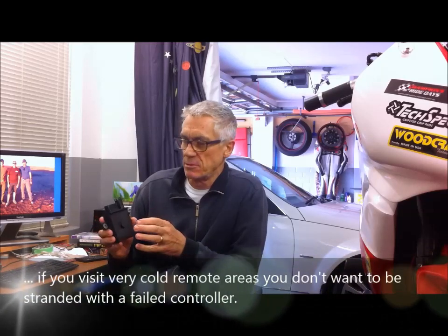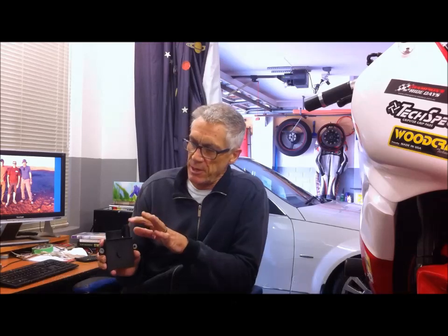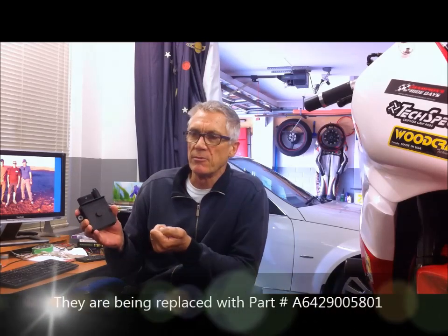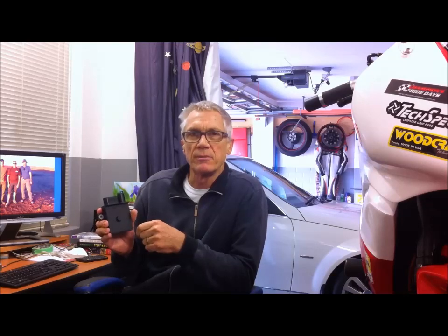The actual circuit board seems to be okay. It's the actual power wires from the main power terminal that connect onto the circuit board. The wires are made from aluminium — really soft, low-grade aluminium — and they fatigue and fracture. So perfectly good control units are being thrown out and replaced with very expensive ones when it's very simple to fix permanently.